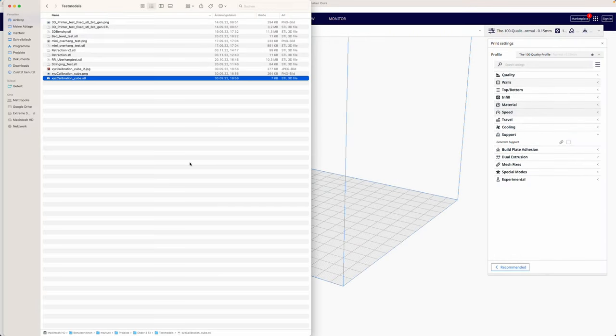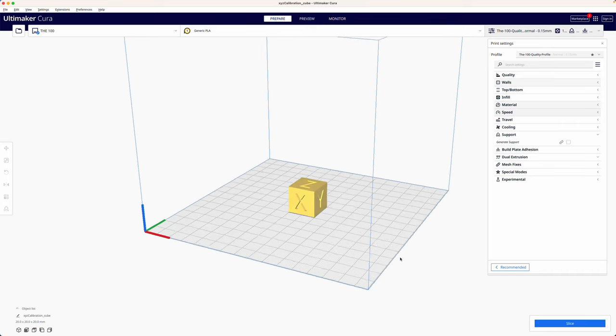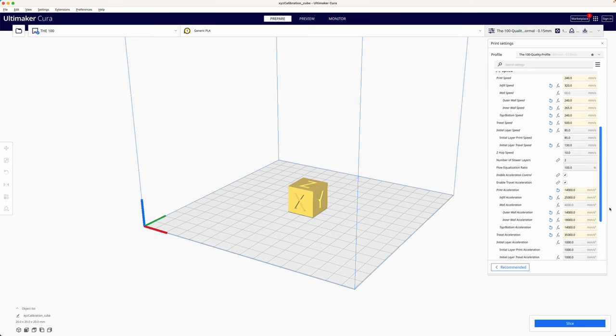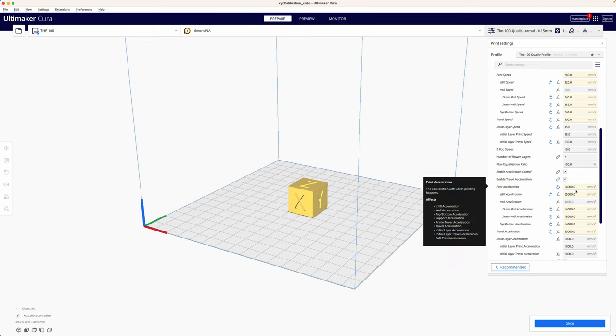Now that we are ready to put our printer to the test, let's print a calibration cube to check the quality of our prints before and after the calibration process. As mentioned earlier, my goal is to tune the printer for quality printing at high speeds, so therefore I will use my quality profile as base with 240 mm per second perimeter speed at about 14,000 mm per second squared